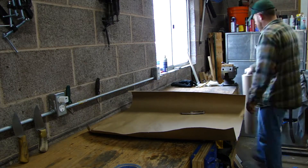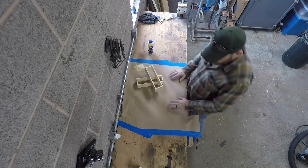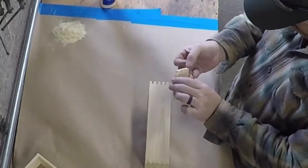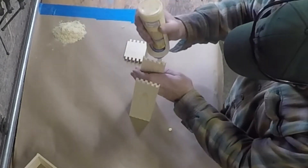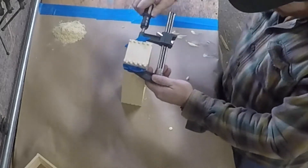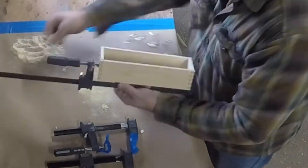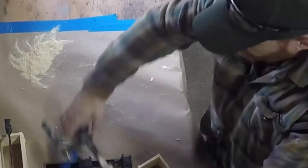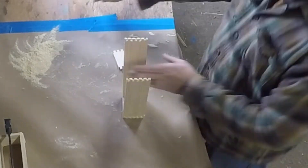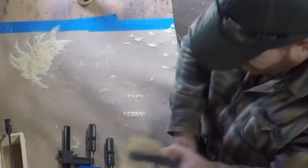Now I'm just preparing for glue-up — you can see my bench looks pretty terrible. This paper is just trying to avoid making it worse than it already is. I just put a pile of glue on these finger joints — it's really sloppy and messy, but it's quick, which is why I do it. Put a bunch of glue in and let the amount of glue push into all the crevices. Then I clamp it up, and I take a little sawdust to fill any kind of nooks and crannies that my poor craftsmanship leaves behind. The sawdust acts like a wood filler, and if you use the dust from the actual cuts it matches perfectly to whatever wood you're using.